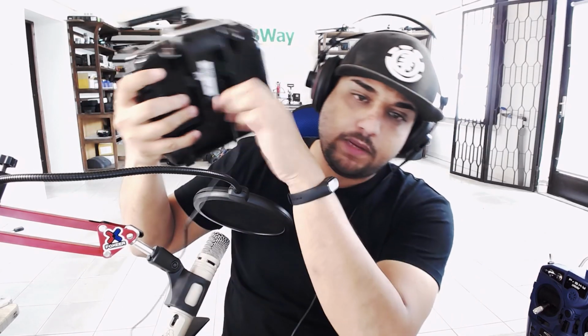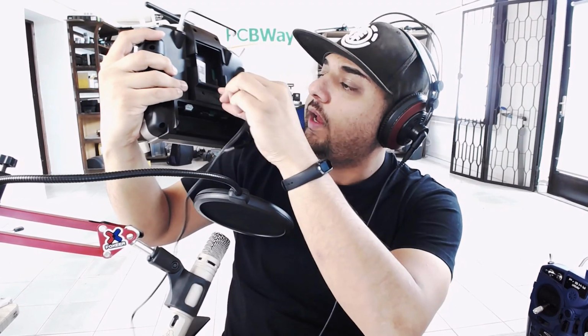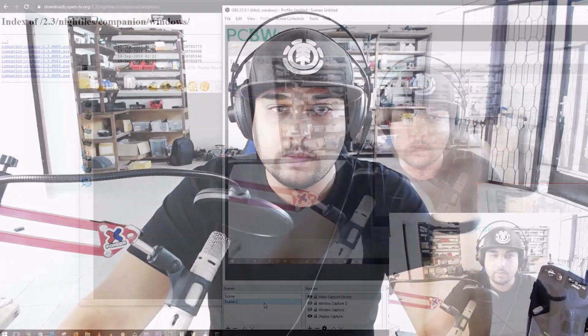All right, so the next step, you want to make sure you have no battery plugged in. That's very important. And we want to install our USB, and we should have a green light. You don't need to press any buttons. That's all you need to do here. And like I showed you in the beginning of the video, make sure it shows up in your device manager. So let's go back into the software here.